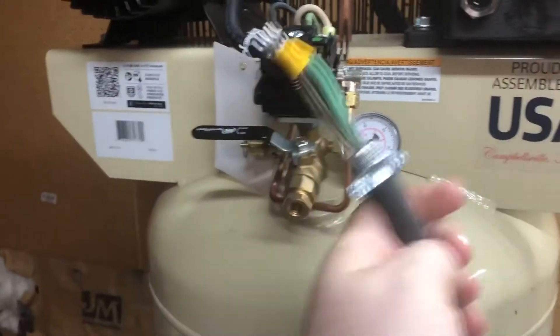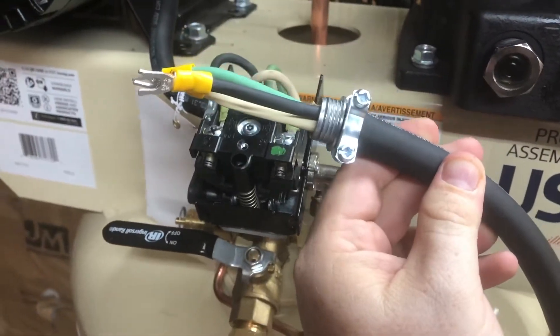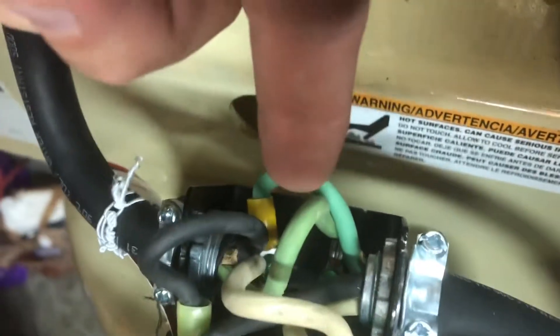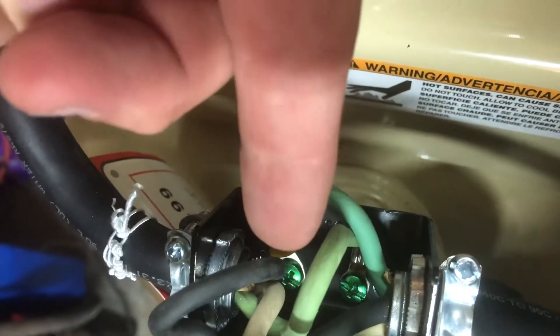I'm going to thread the wire through, get all the little forks connected up, and we'll see how it goes. Okay, I'm back. As you can see, there's not a lot of space in these boxes. The black and white are my new wires from the cord. If you're doing this for a similar compressor, I'd recommend making your ground wire a little bit shorter than your black and white, because I'm running into a space issue trying to fit it on that grounding screw. I'm not thrilled about how this is going to pinch the cable, but I don't have more terminals, so let's get the cover put on.